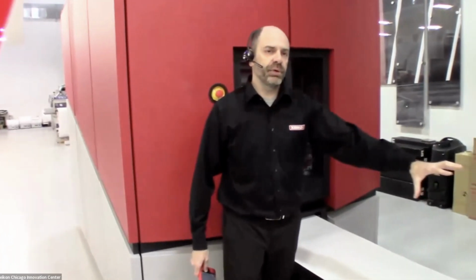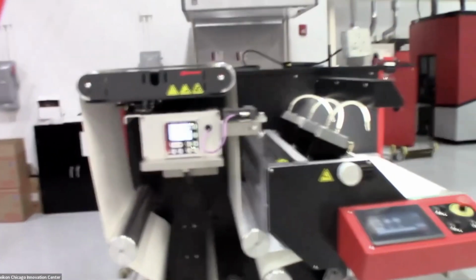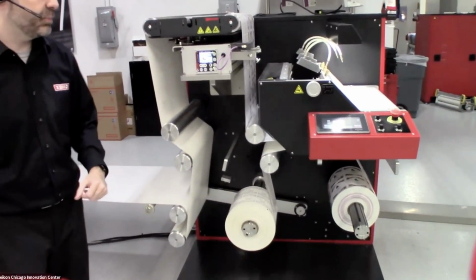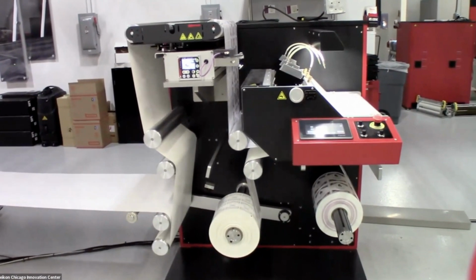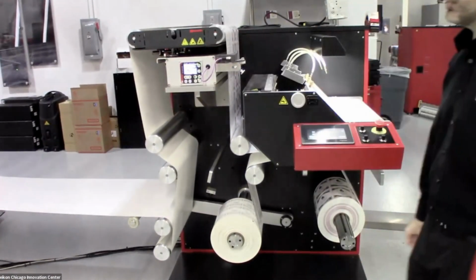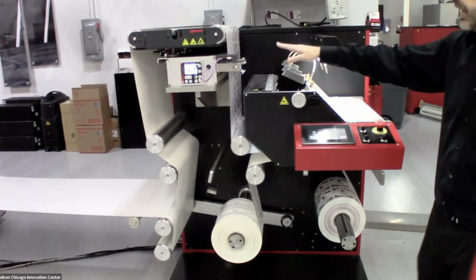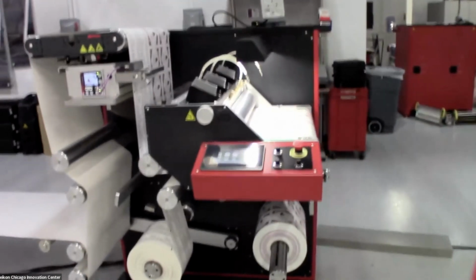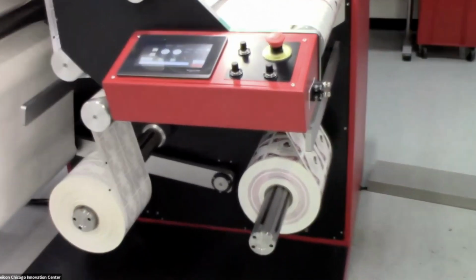From there, because we are using a roll-fed engine, we do also have the ability to put other finishing devices in line. So depending on what the production environment for your shop is, you can either go just to a rewinder as we're doing here, but we also offer things such as inline finishing or varnishing. We offer a Xeikon web varnishing module if you'd like to put down aqueous or UV coating in line to have labels that are ready to go for finishing. Here with our dual core rewinder, we additionally have another active aligner. That's going to make sure that as we feed into our slitting station, the web will not vary in direction. And then, like I said, because we're running the VariLane feature of X800 today, we are slitting this web into 2 lanes so that, again, those 2 completely different repeat labels can then be taken to finishing, and we're getting the maximum productivity out of the CX500 when we're running a 20-inch web.